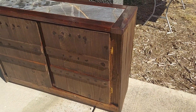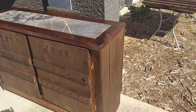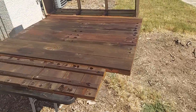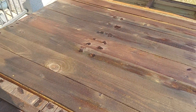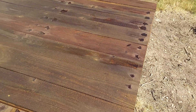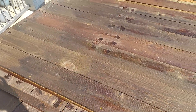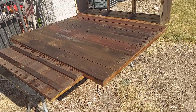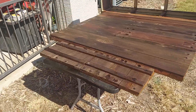They only had one kind of filler and it was a really light color, so it looked like a leopard when I was done. I just refinished it yesterday. This is the backboard — see how it's got dark spots? Because the filler was so light and it was glowing, I used a darker color filler. Right now it's just dry, and when it dries I'm gonna scuff around it, finish one coat, and I think that's actually gonna take care of the problem.